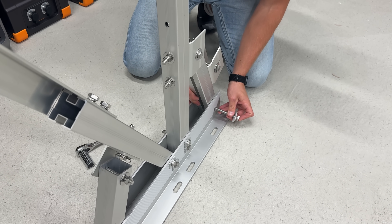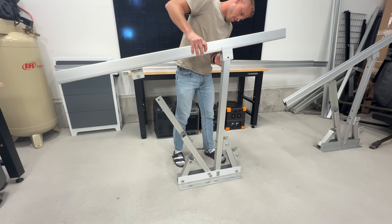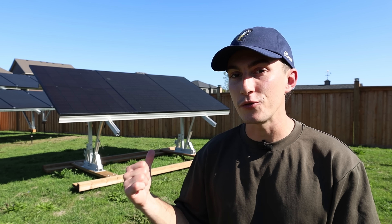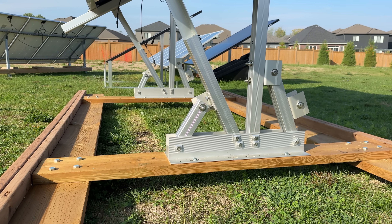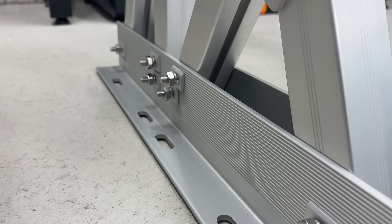The biggest thing that we like with this ground mount is that you can start with one leg and go from there. Most ground mount options that look like this, where you have multiple legs and a big array of panels on it, you would assume you need to buy the whole thing. But similar to an Integra rack or a Power Rack, you can start with one leg and put a panel on it if you want, and buy as many legs as you need. It's really nice because the footings are huge — a really big footing so it can actually bear the weight of just a single leg. Whereas a lot of other systems, like the bright mount for example, they're very narrow and you have to install the entire system to give it rigidity.